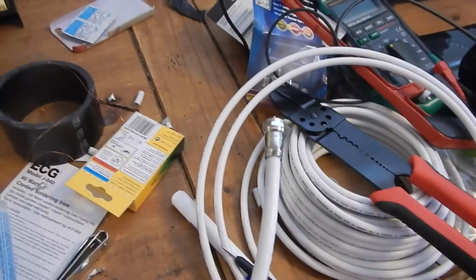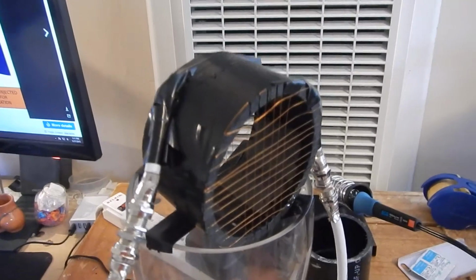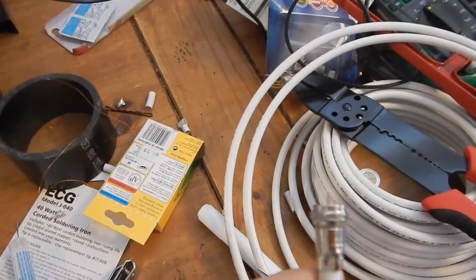And basically these are all hooked up here. You have this splitter here. This is the cathode, this wire here. This first grid here is a negatively charged grid. This second grid here is a positively charged grid. Minus 50 kilovolts, plus 50 kilovolts, plus 50 kilovolts.